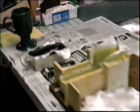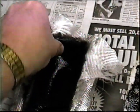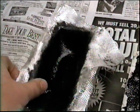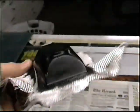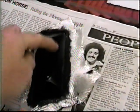We have a new mold that we've been working on. This is one I made with some black resin. I put some black dye in the resin just so I could see how it was picking up the imprint. Now you can see the little errors there, the little bubbles. Well, that's part of running a new mold. You have to find out where you need to pack the mold more. In this case, when we make some more of these, I'm going to try laying a piece of carbon fiber tow around there as a way of filling that. Each time you do them, you learn little things.